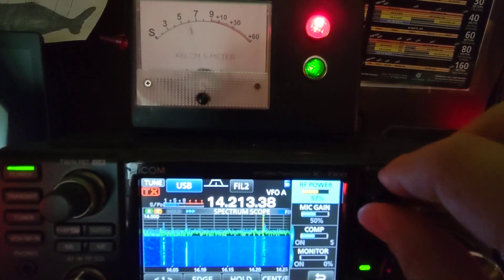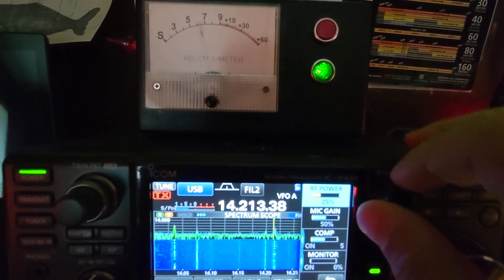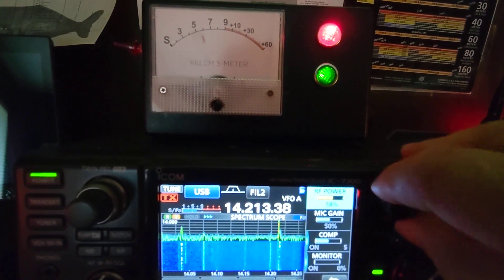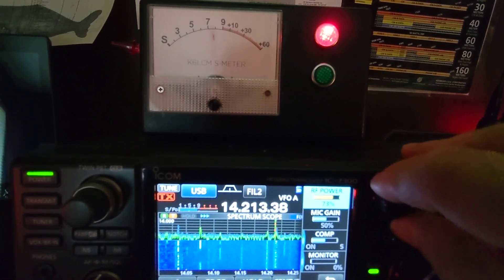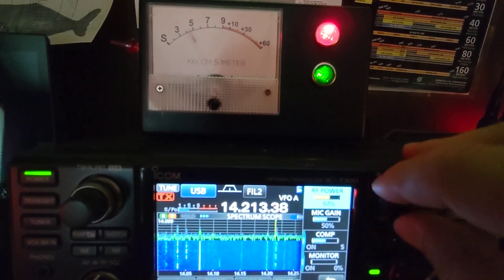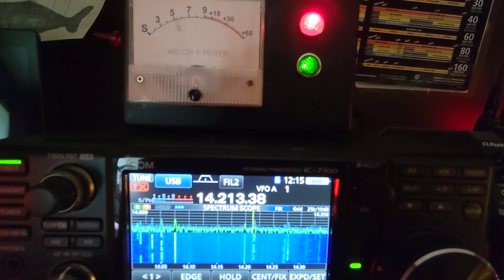I've set these ranges for tuning my Heathkit. I like to tune it initially no higher than 25%, and operate it no higher than 70%. At 70%, if the green light goes off, I know I'm beyond that and operating it too high. It's a good visual indication for amplifier operational safety as well. Thank you.